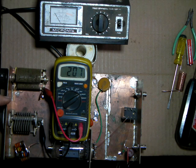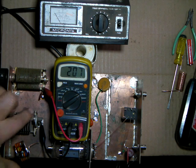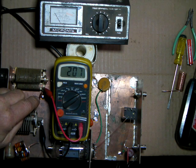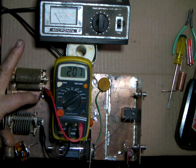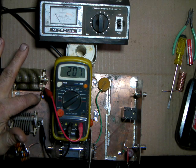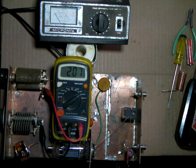So that's why, like I say, if I was to redo this and put it in a cabinet, I would look for maybe one of the ones they call a broadcast band variable, which has a lot more fins, and usually they're at 365 or 400 pF. But this would get you by using a pad cap. The criteria for this one tube, this would be okay. It's only a 1 kilovolt cap, 110 picofarad. You could get by with using a small cap like that.